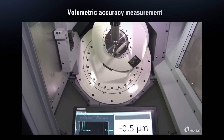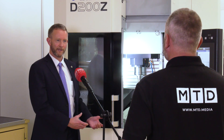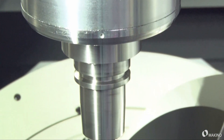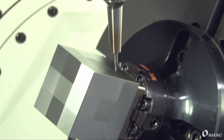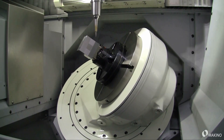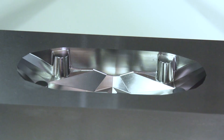On the surface finishing — why is that actually so important to customers? What we find when we produce test pieces for customers on this machine is that we eliminate the need for polishing. So there's a whole process that's eliminated. And even the EDM process as well — you can get the tool complete off the machine tool. So it saves processes and saves other operations further down the line.